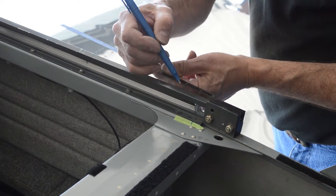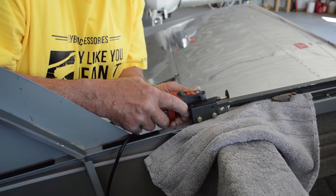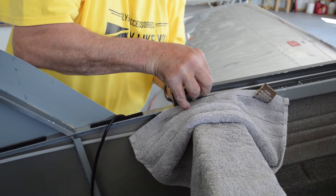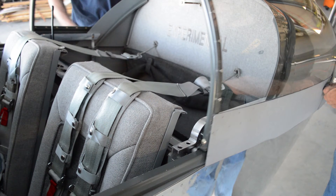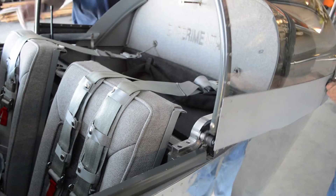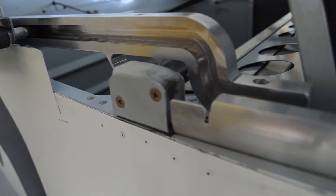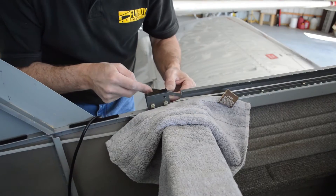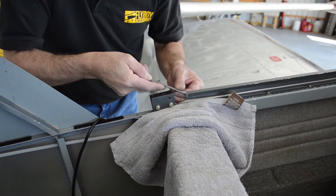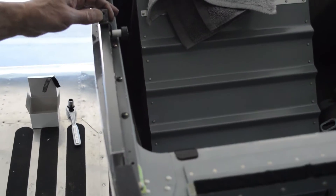Mark a line an inch and a quarter from the aft end of the canopy track and cut a notch out of the top here. This notch will allow the rollers to escape the canopy track to clear the locking block. The S-Tracks will pick up the second roller you've just added, and the rollers transition from the canopy tracks to the S-Tracks as the canopy slides back. Depending on how things are set up on your airplane, you may want to cut a tab in the canopy track and bend it slightly outward, as shown here, to help guide the roller through the transition. It's a good idea to dress these edges with a file before you proceed. Then slide the assembled rollers back into the canopy tracks and up out of the way.